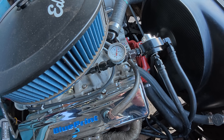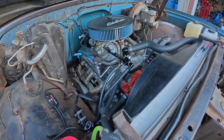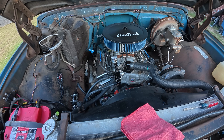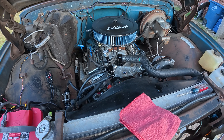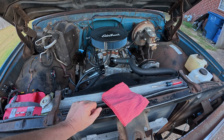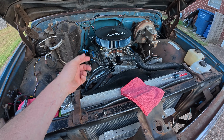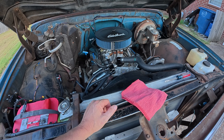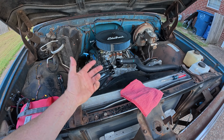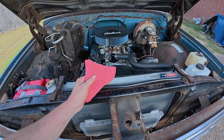Still have her set at 5 psi. It'll bounce for a few minutes and seems to stabilize out — we're in good shape. Just need to put the seat back in, get it all dialed in and put back together. If you have any questions, leave them down below — happy to answer them. Bypass is just a little more beneficial on the fuel side, maintaining the same pressure all the time to the carburetor, which is what I was interested in especially with the dyno testing coming up soon. We'll catch you guys on the next one.